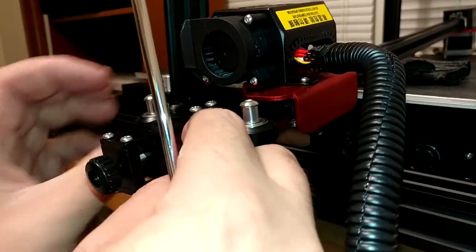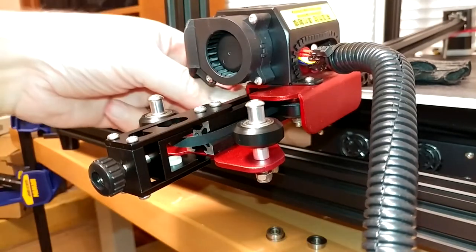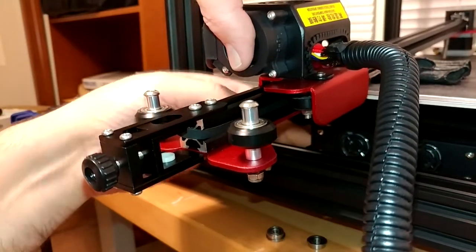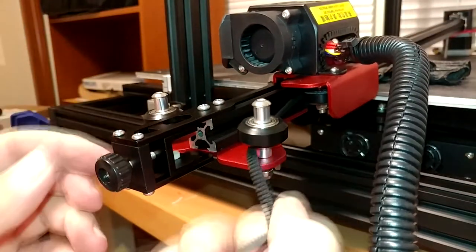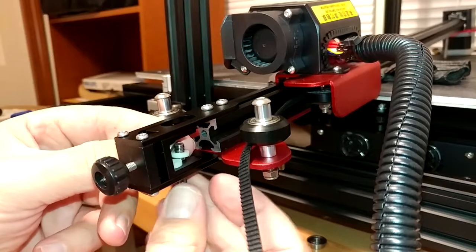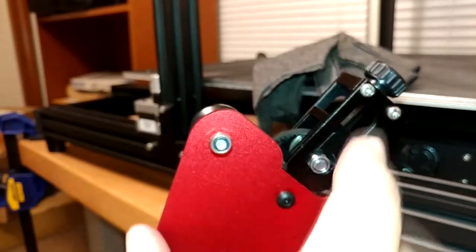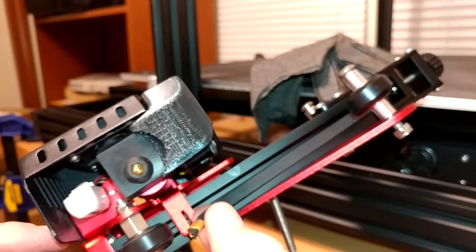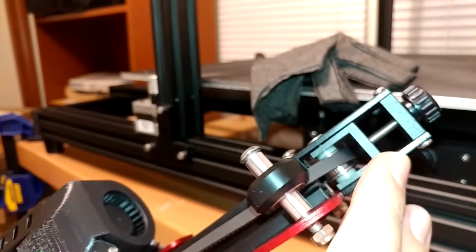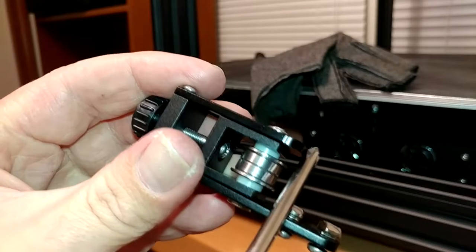So that's as far as it's going to go in without modifying parts — it's hitting right down here. We just need to try and get our belt around the pulley. It's probably not going to be much fun. Actually it's really easy to just slip the belt out, so that's what we're going to do. Now I feel dumb because I didn't have to take this thing apart at all — could have and should have just left it together. So can confirm this kit does not fit a CR-10 Max very well. I need to go grind some of this off so it can recess in a little bit more. The belt just straight up isn't going to fit back on because there's not enough slack. We're way out of space to loosen to get things to cooperate. So I'm just going to go grind about a quarter inch off of that guy.